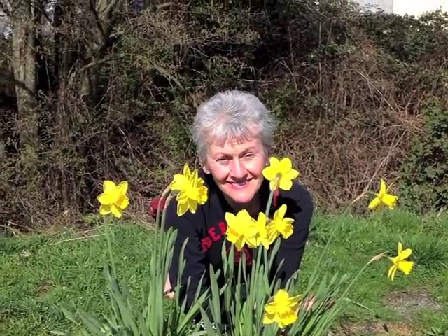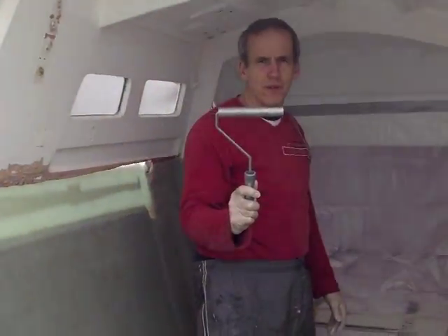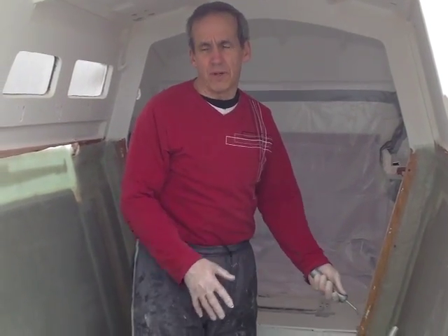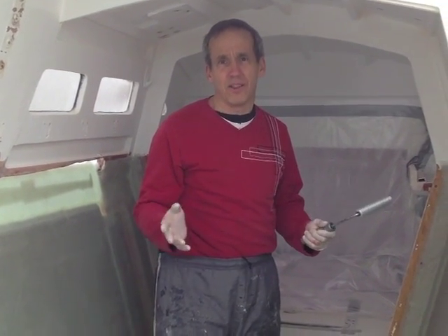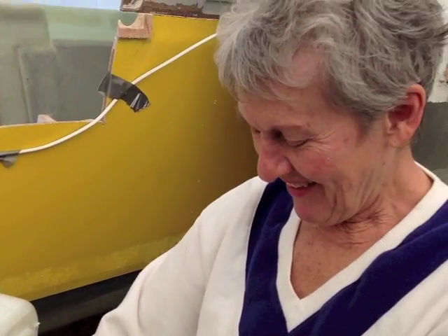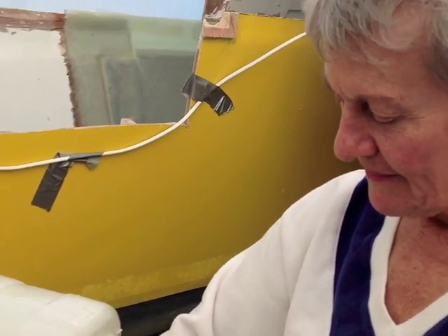It's not all work in the boatyard — these daffodils smell so nice. It's a beautiful boatyard! Time to go work on the boats. We use the metal grooved roller over the fiberglass to get out all the air bubbles and make sure it's really strong. If this breaks, the boat falls in half — Carly doesn't want that. How many batches today, Carly? This would be 17 now.